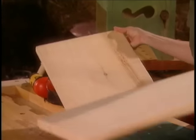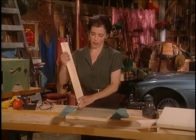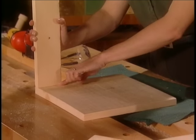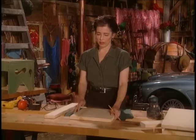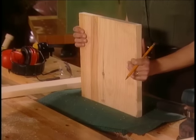The side pieces that have the V-notch and the scrolling work come out of a sheet of wood that's just one foot by one foot in the particular size that I'm making. It's up to you to decide on the dimensions. After you've got the pieces all sanded — and there's just five pieces, so this is a really good project — we need the side notches where this piece of wood is going to go. One way to do that is to trace them, just trace the outside edge of this board. Also, the end grain should be facing down — there's more strength in the board that way.